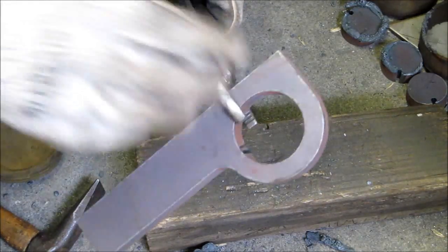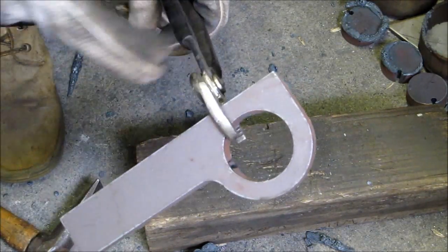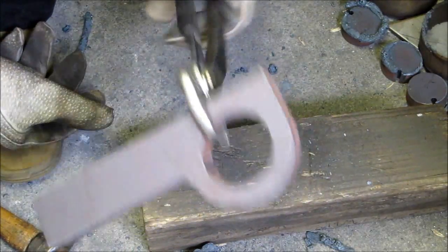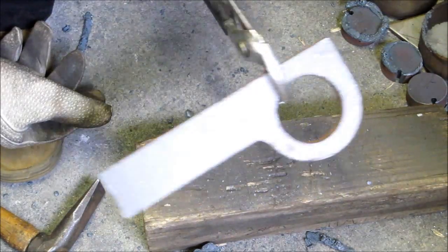Look how square and nice those cuts are — I have no complaints. There's a little tiny bit of drifting because of how much heat we're causing, but you can't ask for much better than that. We're going to be doing machining on all sides here: boring, splitting, drilling and tapping. There's going to be a lot going on, but getting them roughed out to this shape is pretty cool.